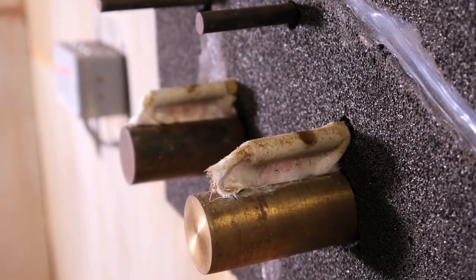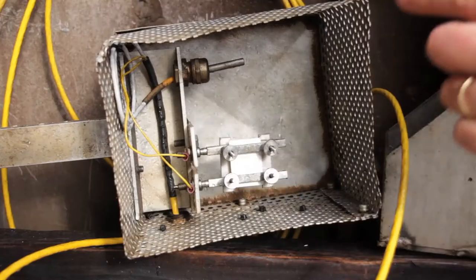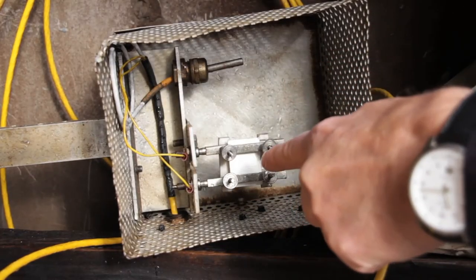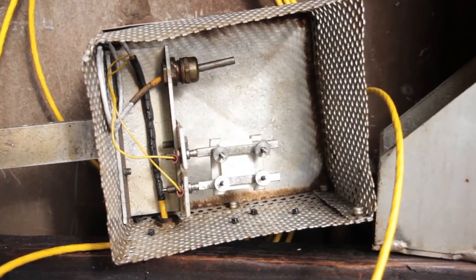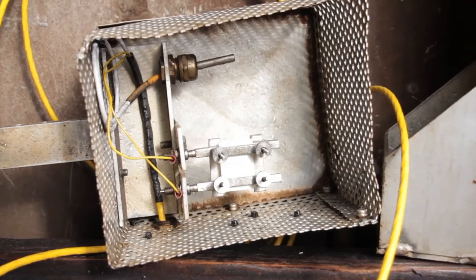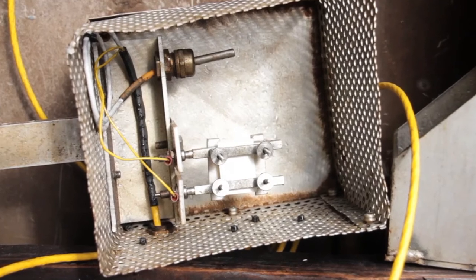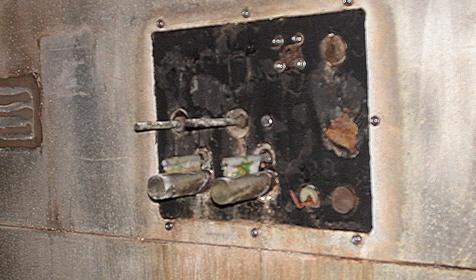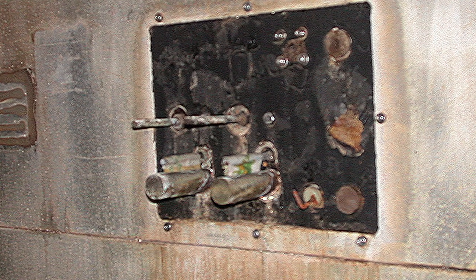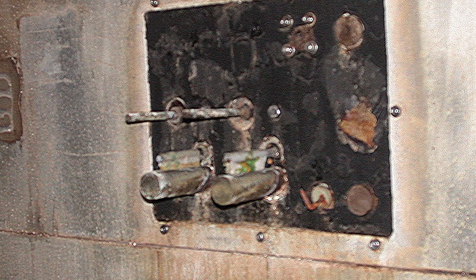The climate sensors are an important functional element of every drying chamber. At least one thermometer and one humidity sensor on each side of the drying chamber is required for reversing operation. The temperature sensors must be kept clean, and equilibrium moisture content (EMC) sensors must be replaced regularly. In the case of psychrometers, make sure that the wet sock (wet bulb) is absorbent and not dirty or calcified.